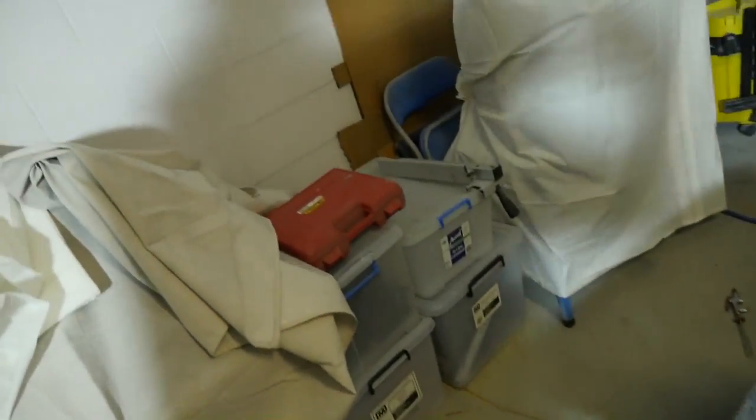Going through the sandpaper grits wasn't a problem. It was how it usually is when I polish acrylic. Very quick and easy. The gaps that I have between the sandpaper grits work well. The 800, 1200, 1500, 2000, and 2500. It was when I was going from the 2500 to the coarse sponge, it took far too long to remove those scratches from the 2500.